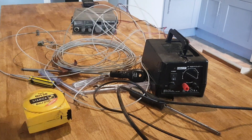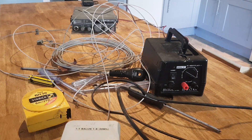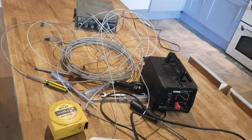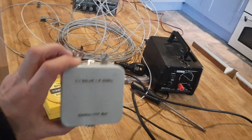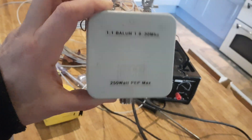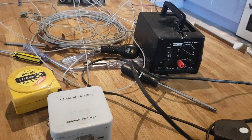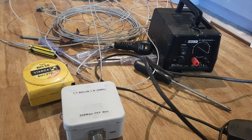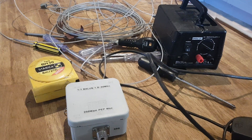Welcome to my channel. We've decided we're going to make a CB dipole, so we're just going around looking at what we've got lying around. I had a G5RV but I threw that away — I always keep the wire though. I've also found this which I didn't realise I still had: a nice one-to-one balun, so that's going to help with the SWR. We've gone to a calculator, which you saw at the beginning of this video, and calculated that we need two lengths of 2.62 metres to get us on about 27.200 megahertz. So let's do it.